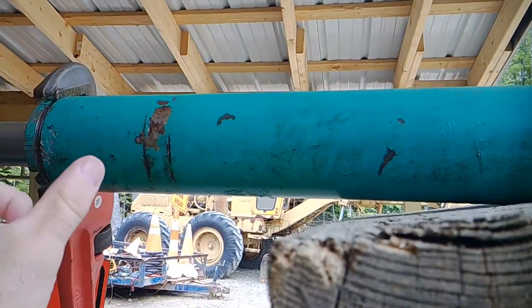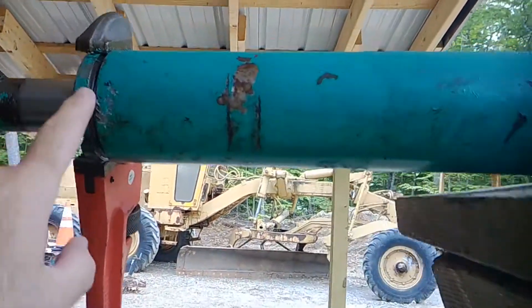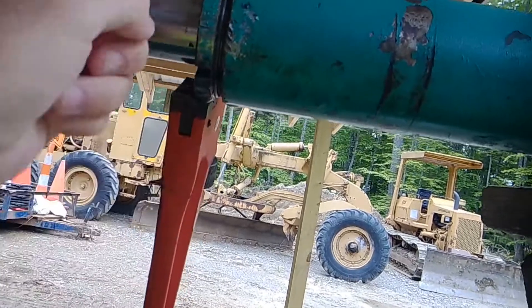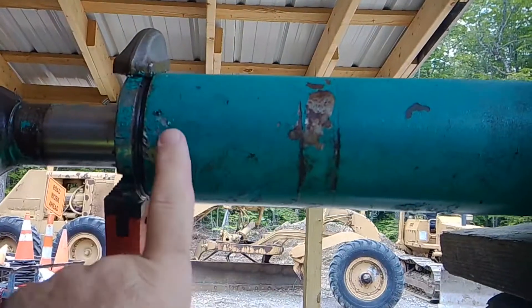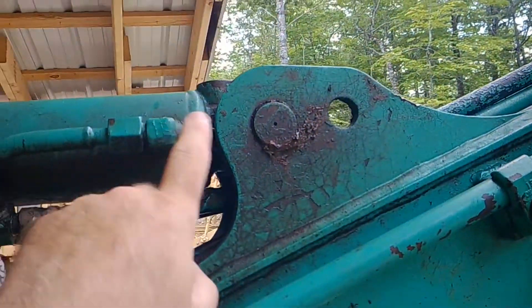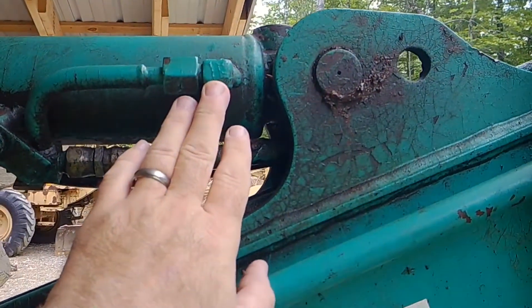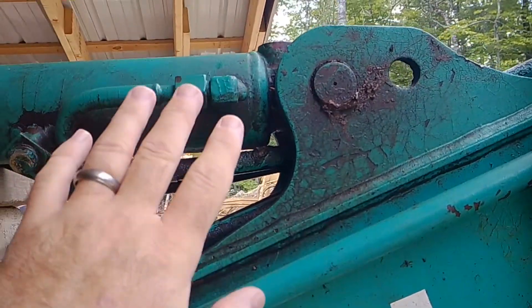At the inside of this, on the hydraulic cylinder, there are some seals in the very back that are going to need to be changed along with this one. The leak is coming right from here, so the cleaning seal and the internal seals are all bad. I'm going to replace them all since you've got it apart - do it even if those look brand new, change them.